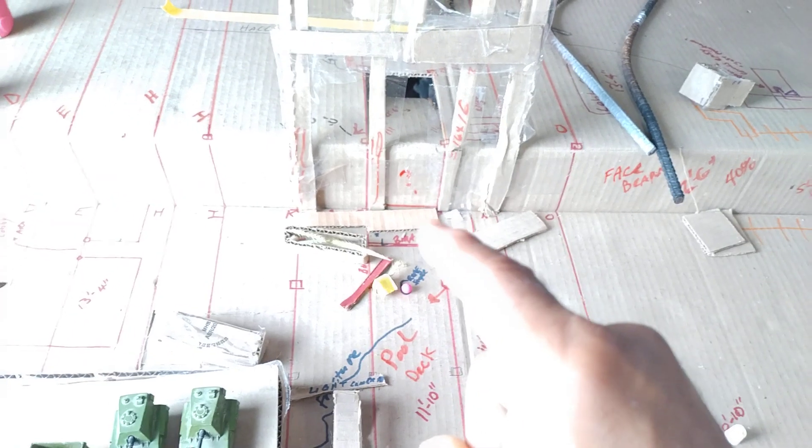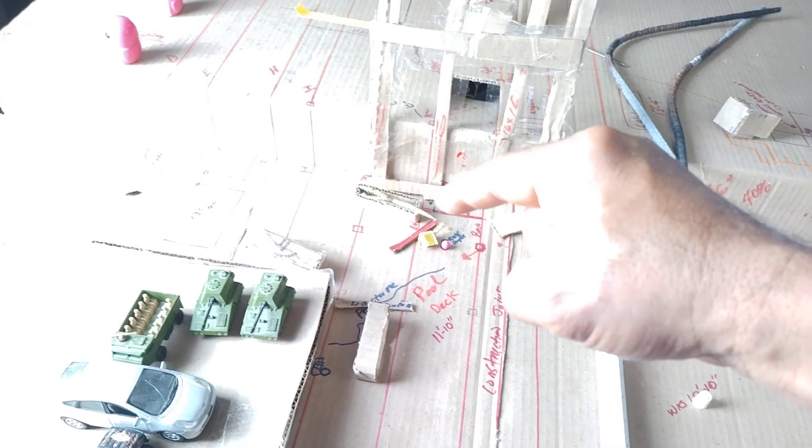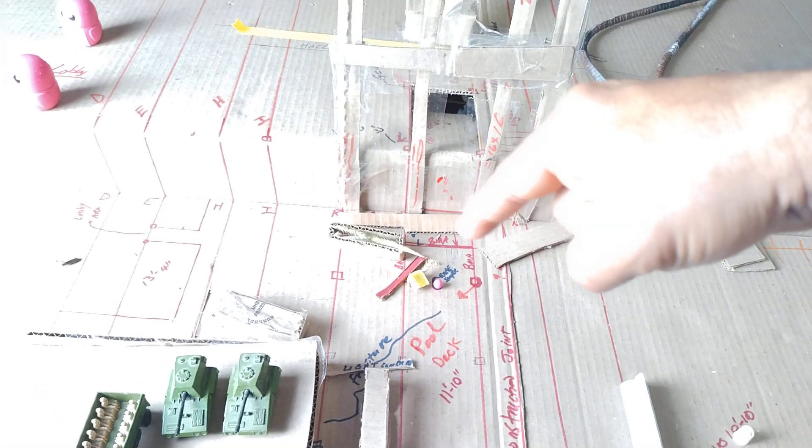This is sort of like my teaser video. The location of the exploratory holes are not as mapped on the drawings. It's not as mapped on the drawings, and I go over those details. But why would he or the company by chance check right here where we see the failure, expansion, the shear failure, and also right there? Why would they check those two spots specifically? Also because the BMA is failing — that's why — because he or she sees the fractures right here. That's where I believe it is, and that's why I said let's go ahead and check the deck out here. I believe it's right here on the BMA type A, and the assessment is this needs about four million dollars of work out here, which will ultimately probably result in the entire deck replacement.